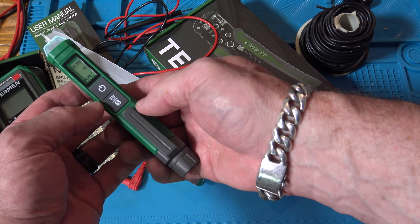I wonder if that ground reading is because of ghost voltage. It still detects on the neutral and ground, which is interesting. If I switch to the 70-volt-to-1-kV setting, it stops detecting — so it's picking up ghost voltage at the lower sensitivity level, reading around 52 percent, maybe around six volts. Pretty nice feature.